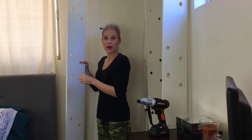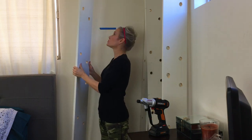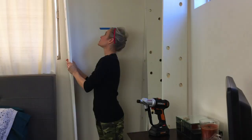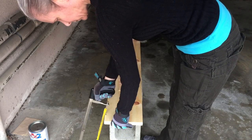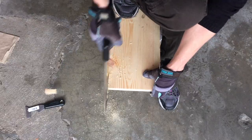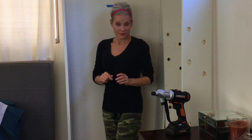You might choose to paint these as well — I'm never going to see them since there's going to be PVC pipe in there, so I didn't. Now we're going to mount these boards. I want them to get right up to where my existing curtain rod is. Because I have molding on the floor, I made a small notch in each of the boards to accommodate that so the boards could fit as flush as possible to the walls. I would love to say these walls are perfectly square and flat, but this building is older than I am, so we know they're not.